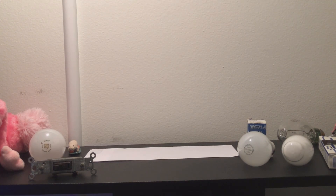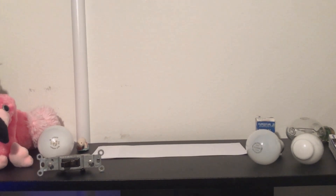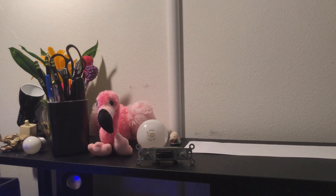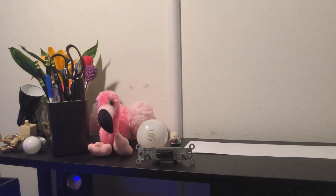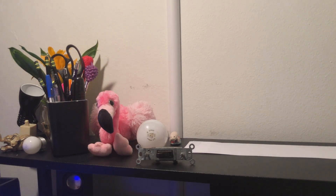You can probably tell that this is more like halogen light than incandescent light. It's got that like 2,900K color — these are around 2,850 to 2,900K. It's a pretty nice color. Now, supposedly these daylight bulbs have a slightly lower CRI than a standard incandescent bulb — it's like 91 CRI instead of 99. But I'd say it's absolutely satisfactory, definitely better than an 82 CRI bulb like a CFL or LED bulb would be.